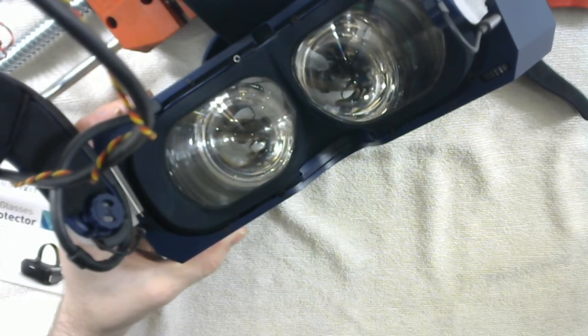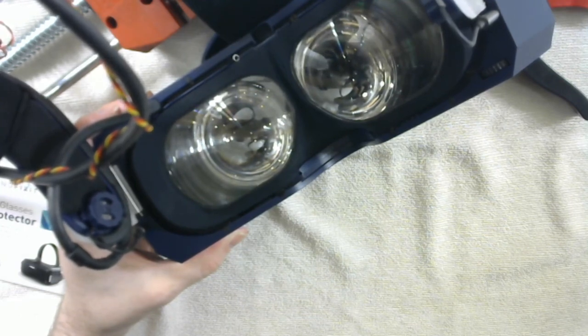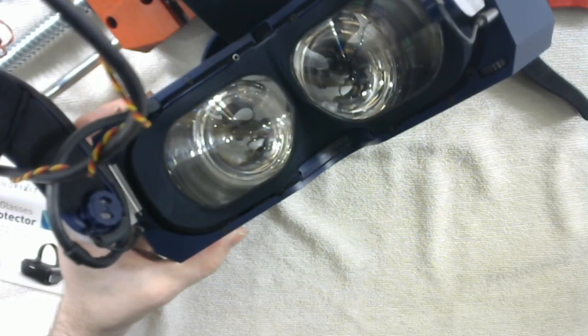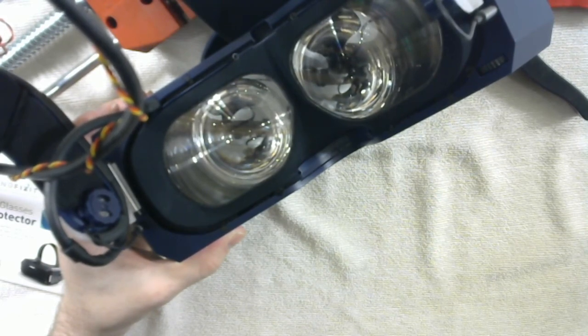Keeping in mind, of course, that if this is a very hard material that's being applied, a thickness much greater than half a micron might actually cause it to be more likely to crack, if that's even possible. Considering, of course, that it's likely that it would have a different thermal coefficient of expansion, things like that. Different mechanical properties, different thermal properties, maybe even different chemical properties.